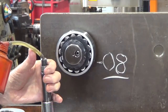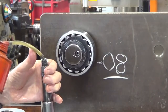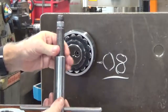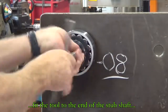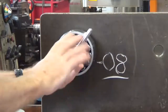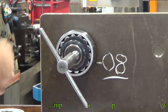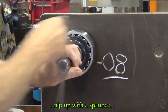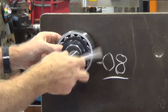What we're doing here is unscrewing the spindle section inside the hydraulic release tool, then priming it up with oil. There's a plunger in there — I put a pin down in there just to make sure the piston was right down at the bottom before priming it with oil. Screw it into the threaded connection on the end of the shaft; there's a T-handle on this, and once it's in, nip it up lightly with a spanner. Once nipped up, wind the T-handle in — that forces the oil through the centre of the shaft and out through a hole underneath the bearing, and you can see the bearing move forward as it ejects off the tapered shaft.